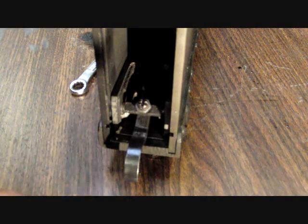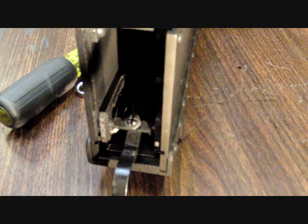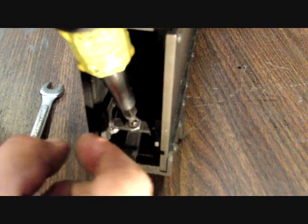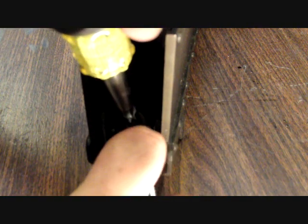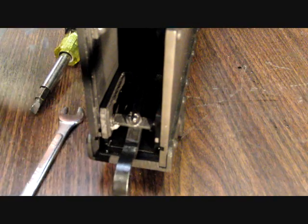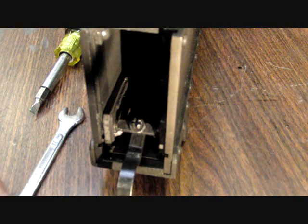To test this, screw back in a few turns, recharge the gun, then put the feeler gauges back in between the trunnion and the barrel extension, and unscrew it a few more turns until it stops. At that point, keep your screwdriver tight, take your 3/8 wrench, and tighten the jam nut. Your timing is set. Re-cock the gun, bring it back forward, and when you pull up it should just trip the firing pin — which it did. You can test exactly what point the firing pin drops by varying the gauge distance to find exactly when it does and doesn't drop, which gives you your exact timing spec.